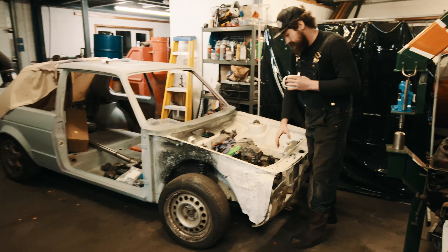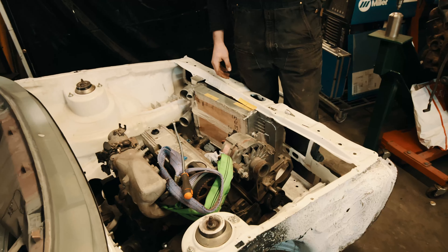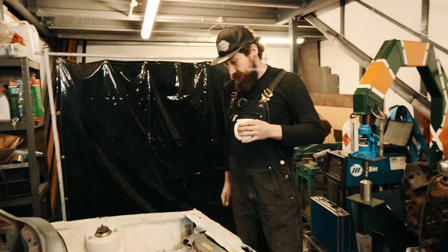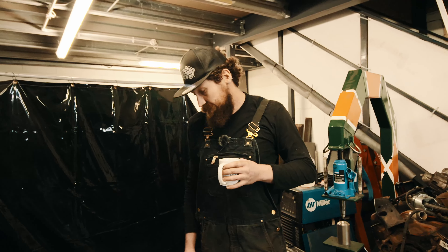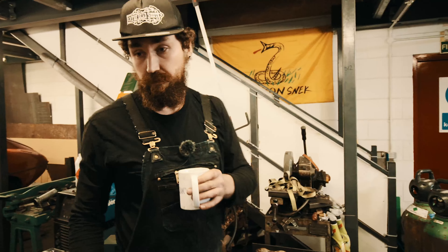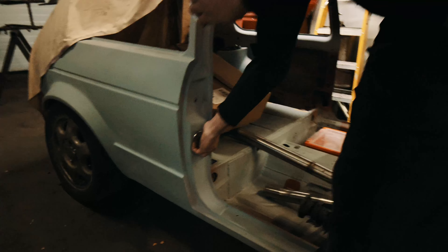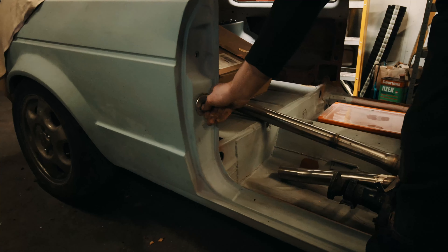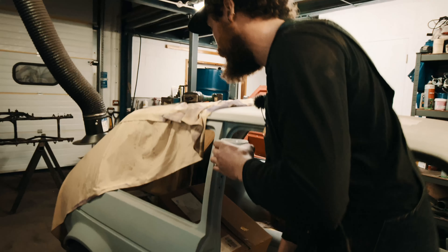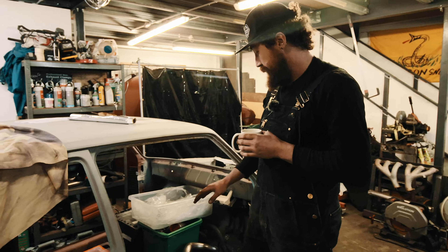First step just now, we've been mounting up the radiator with an intercooler combination unit. Then we'll get the supercharger mocked back up, sort out boost pipes, a few little cuts and things. The owner wants to tuck all the wiring in as much as possible, so we'll help facilitate that, and then move on to the filler neck which is tucked in here behind the door. We'll just need to plumb that into the tank and sort out the breathers.